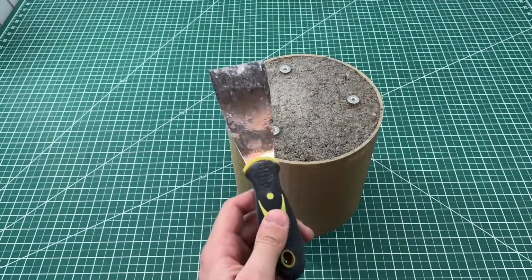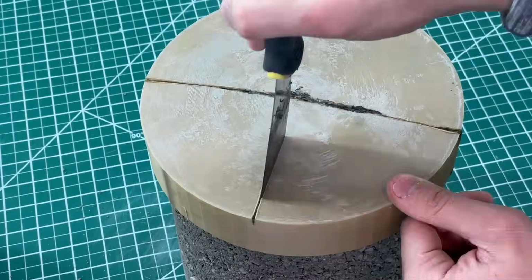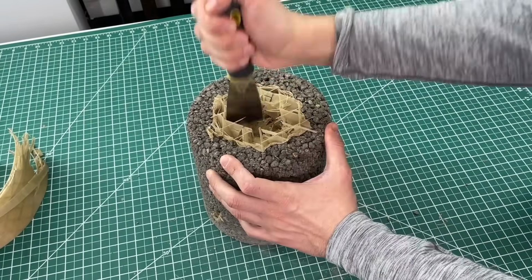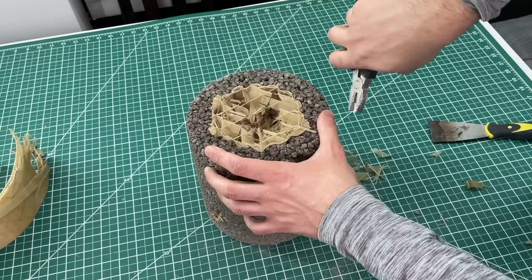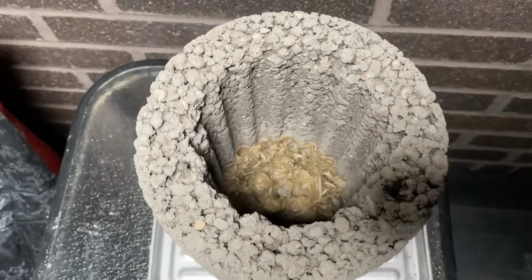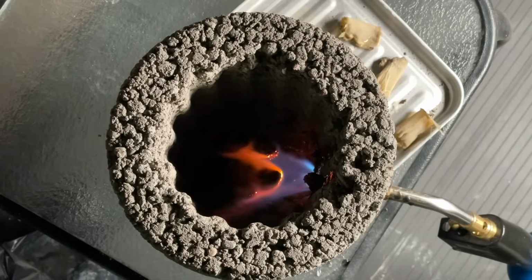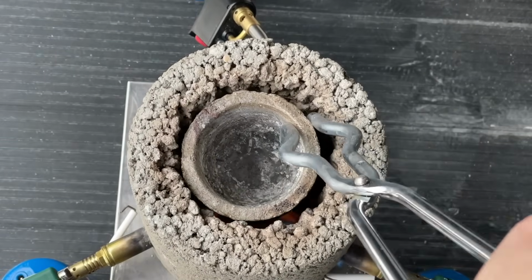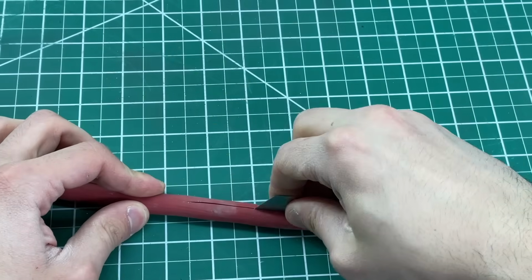Once it fully hardened, we proceeded to remove the plastic shell, which was much easier since there weren't two insulating walls to dig down between. For the inside, we kinda just hacked away at it and removed as much as we could with pliers and then just lit up the foundry to melt the rest. This worked really well. With the foundry ready, we put the crucible inside and while it was warming up, we prepared some of our scrap copper.